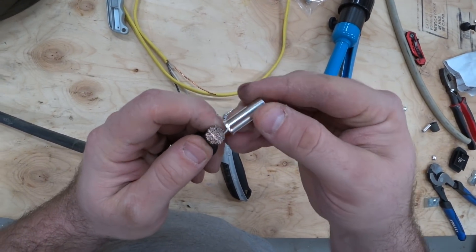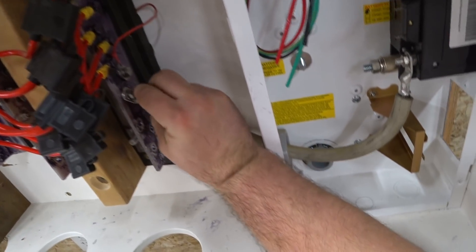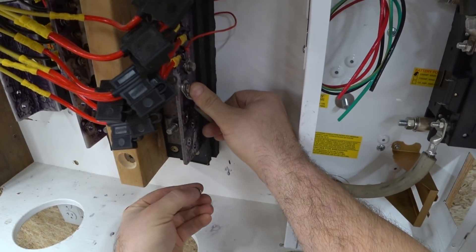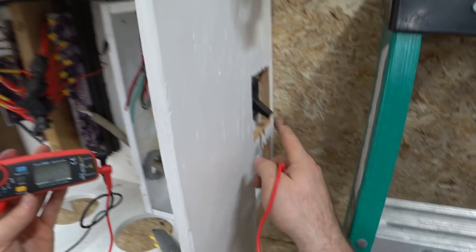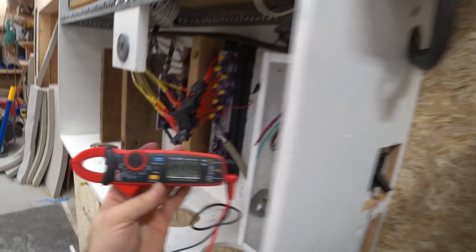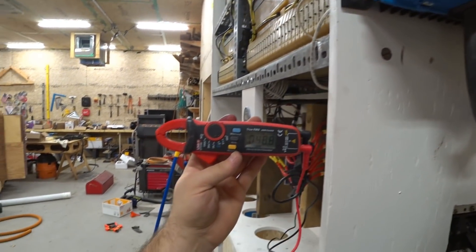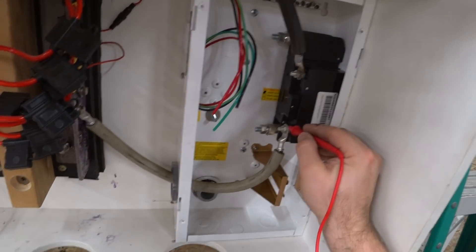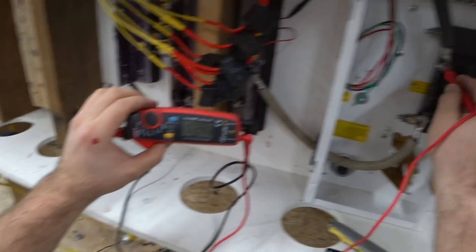I think this is more than two gauge. I have these 10 millimeter nuts with a washer that's kind of serrated — let's go ahead and get that on. Let's go ahead and turn the breaker on; these will probably light up when we do. They did. So now at the top of the breaker: 48.8 volts. And over here: 48.8 volts. So this is now on. Let's go ahead and turn that off and verify we no longer have voltage. It's showing something, but that might be because of this connection.